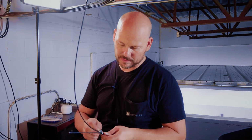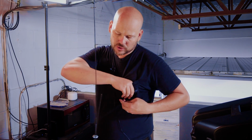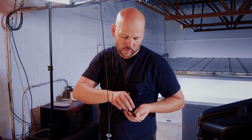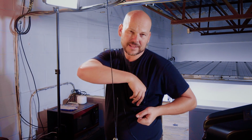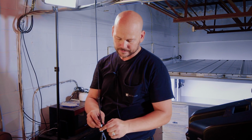The other thing that we're gonna do different back here in the back is we're gonna use 2 Crosbys. Now, if you have been paying attention, I talked about 2 Crosbys are for when you're adding a load. Let's say you're gonna walk away for lunch, you're gonna leave a load on the wire, maybe you can use 2 Crosbys in that situation. The reason we're gonna use 2 Crosbys on the back of our leader here is we need to create some extra friction, because when we set this angle, the speaker's gonna want to pull away from us. Having that second Crosby really helps us have that extra amount of friction that we're gonna need so that it's a little bit easier on us as we begin to pull things.